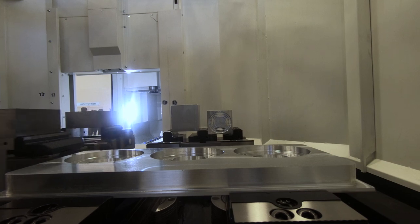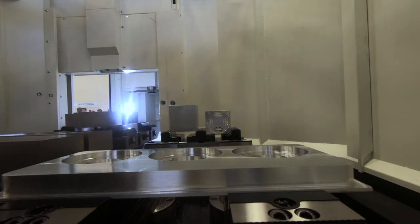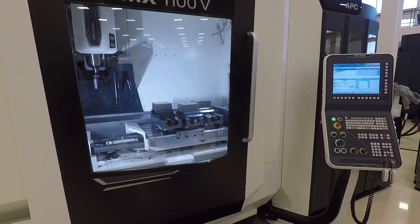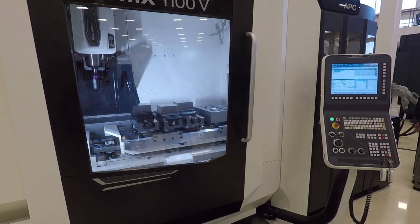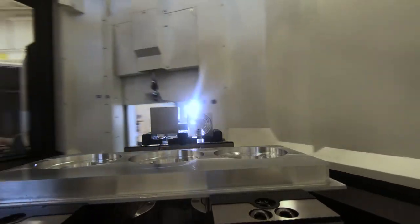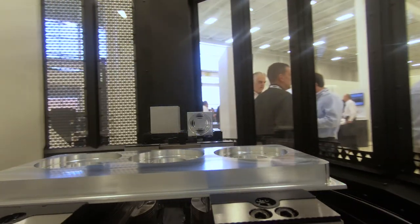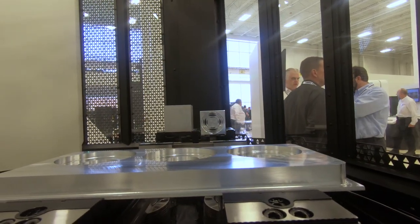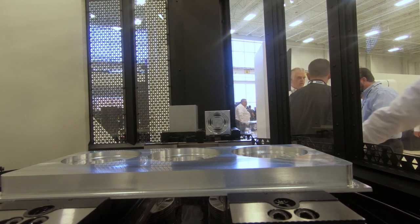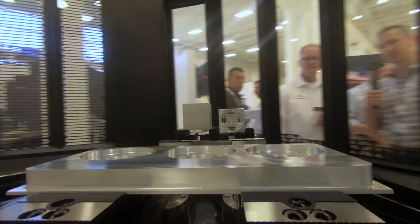This table swap is an interesting and probably easy way to implement automation. My reaction is you don't have the gains of a full blown palletized system with three, four, or ten pallets - but this is more actionable. You've got less investment in workholding and tooling, and for the ability to hit cycle start and run that second shift overnight, this gets you doing that right away.